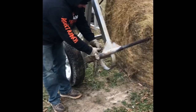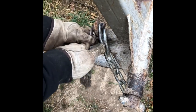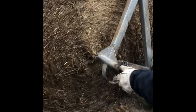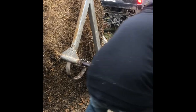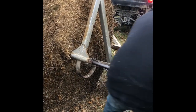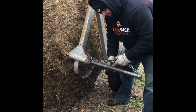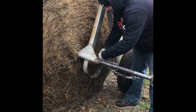Now, after you push it in, you put your chain through here. There's a spring clip also included. You connect it — that way it can't come off of this hook. Now, whenever they get over here and you're not perfectly backed up, it looks like it's going across the grain of the bale and it's going to be hard to push in. We push it in, we twist it, we pull it out, we twist it, we push it on in. Your other spike is all the way in. So we go ahead, connect the chain, and move our spring clip back up to the hook.